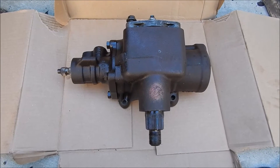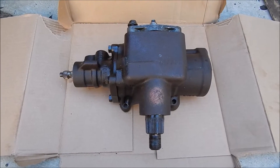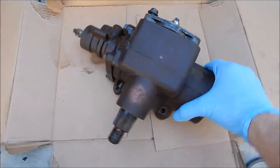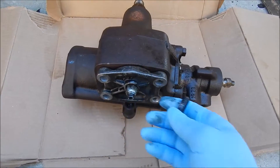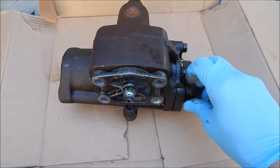Those procedures are going to be drilling and tapping a 2003 Ford Excursion Super Duty steering box. I'm not going to go over the removal from the vehicle, but once you get it out, that's what you're left with. What we want to do is take off the top cap, already undoing the nuts and the front bolts.